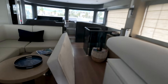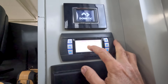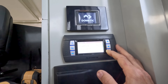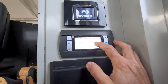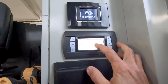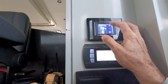It's freezing in here. Let's go see if we have any alarms. Wow, that's awesome. You can see our chilled water supply temp is 49.6. All the sensors are good — that's the chilled water return sensor, chilled water supply, and the conditioner outlet temp. Set point is 43. Pumps are both on. Chiller one return and supply are both good. Chiller one is not running right now. All temps and pressures are good. Chiller number two — you can see it's probably running because it's a little bit cooler: 46 and 49, that's good. Switches are okay, and it's running at about two-thirds speed — they're variable, they ramp up and down RPMs as demand increases or decreases. All the probes are good there.